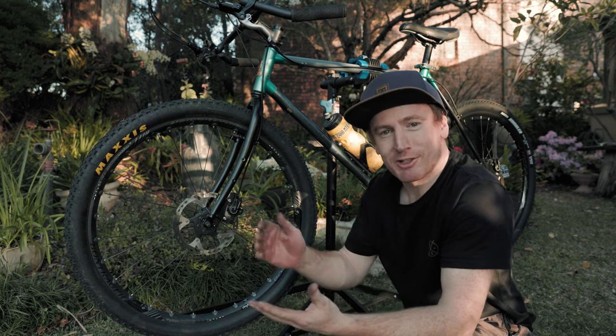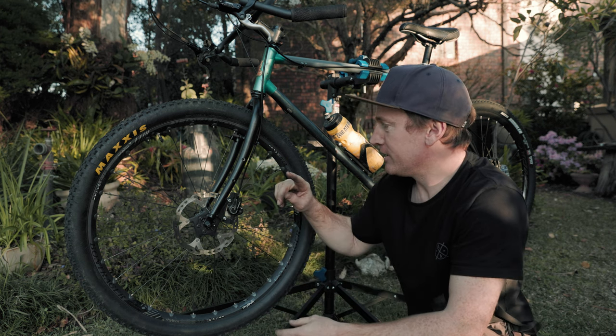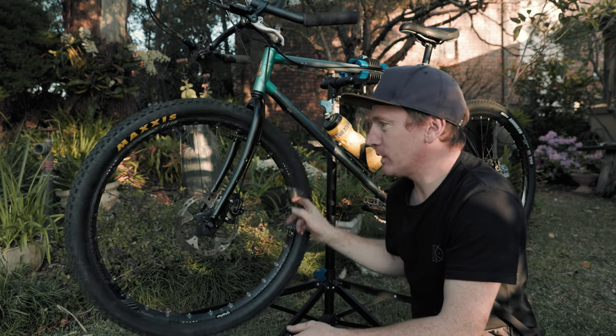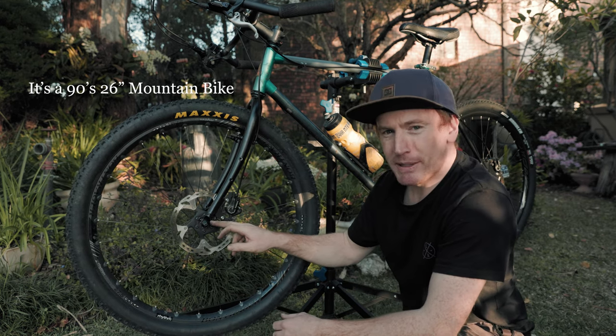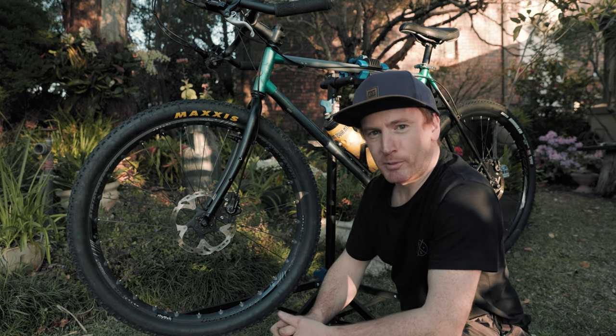This one's a little different to what I'm normally doing, but it's a bit of a build style. Now, this video is all about me converting these forks to be able to fit these 27.5 inch carbon fiber wheels. This is a thru axle style wheel, so I've put in different dropouts, I've welded on some disc brake tabs, and I've also put in a couple of bottle bosses.